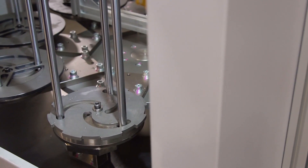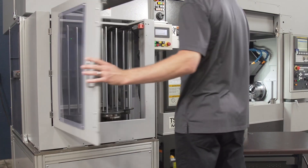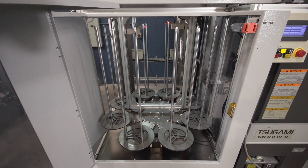The 8-stacker accommodates work diameters from 4-inch down to 1-inch. The stacker can be loaded one of two ways: 7-load and 7-unload. Or, if part diameters are less than 2 inches and the factory integrated parts catcher can be used, then 8-load stations can be utilized.